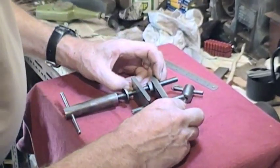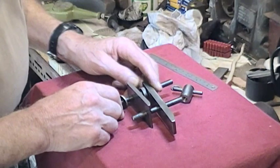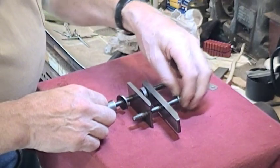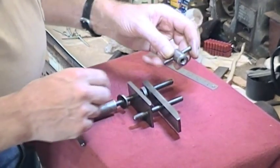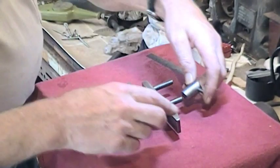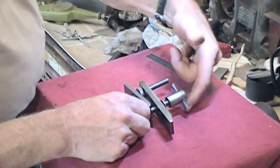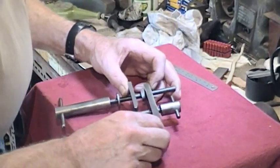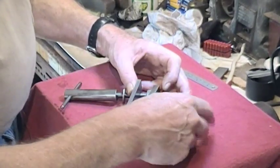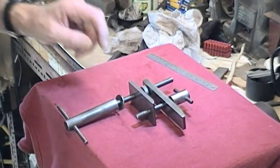Drop that down there and put the jaw on. So what we're trying to show here is that this little shoulder button is the support for the rear. Then we have another washer and this T-piece — which I've got a close-up of later — is radiused also so that when it bears on the washer it can cope with a change of angle. You can probably see that if that is pivoting and we want to apply central pressure, this needs a slight radius chamfer on it, and that's really all there is to it.